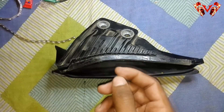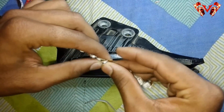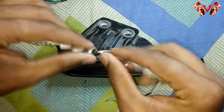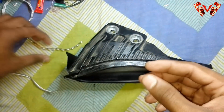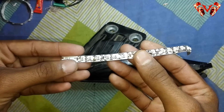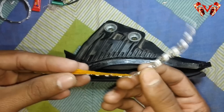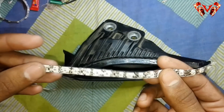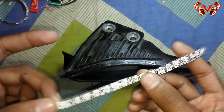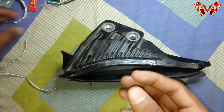I was originally using individual LEDs but tried making them more linear. That failed because where the spikes are, the copper of the LEDs was getting detached. So I'm recommending this LED strip instead — it's more reliable and looks more linear, like neon rather than visible LEDs.